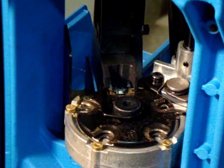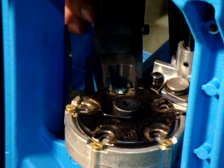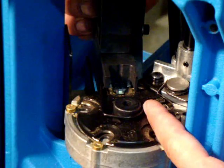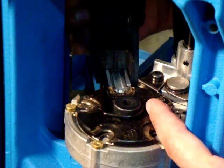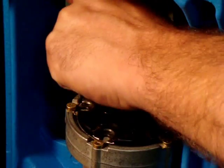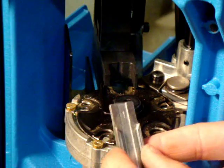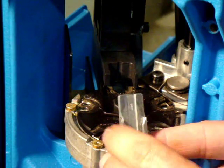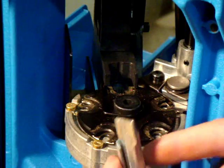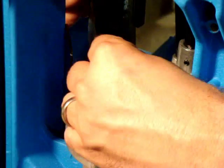There are four parts in your caliber conversion kit just for station one. The first part is the station one locator, located underneath the mechanism. As you pull out on the mechanism it will expose the locator and you can lift it out. Like all parts on the Dillon, it will have either a number or a letter designating the size. To put the locator in, pull back on station one and drop it in.